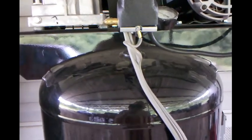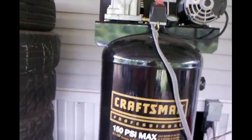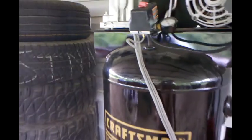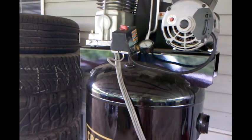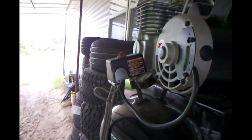Alright. Let me figure out what's going on, guys. Hey guys, we're gonna try this again. There wasn't anything wrong with my wiring. It was showing hot all the way up to the contacts, and after fiddling with it for a minute, it appeared to me the contacts, when I turned the switch on, were not springing up to make contact. So I just pushed them one time and they went right back down.